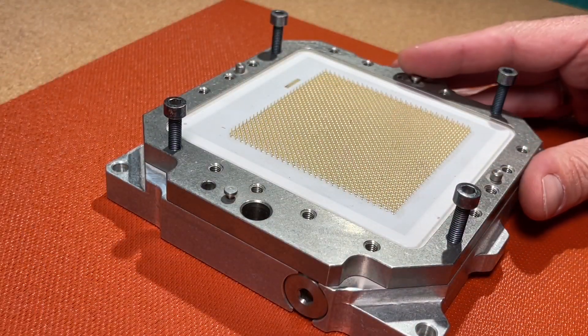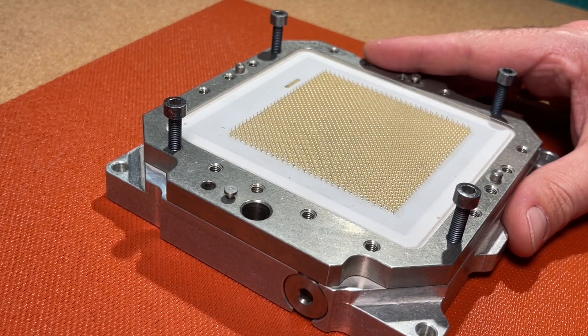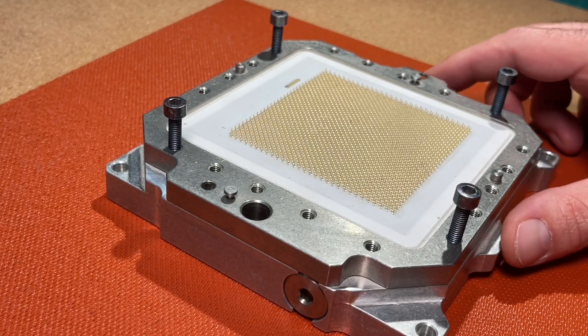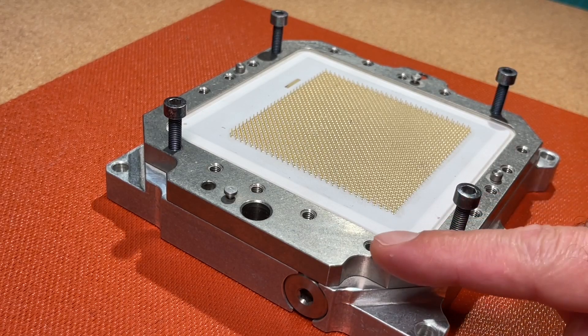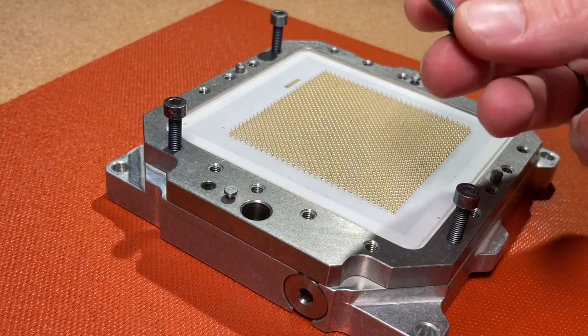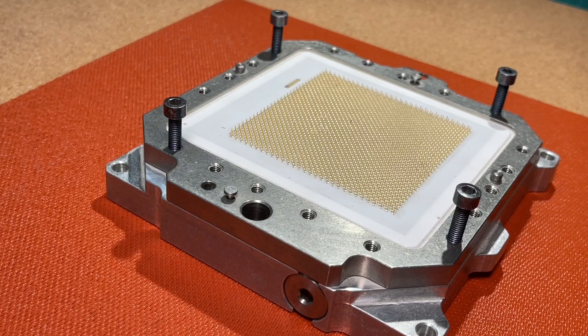Most of the screws are removed, which felt like removing the screws of a cylinder head in a car engine. When I remove the remaining four screws, the top part might slip to the side and this could damage a die. Due to the fact that we only have threads on the back side, I'll put another four screws fully inside to give the top part proper guidance to lift straight.